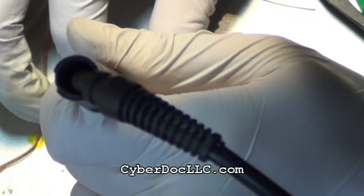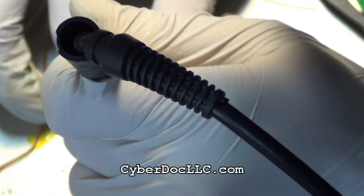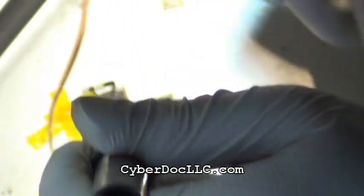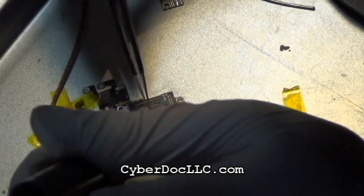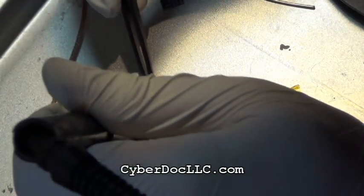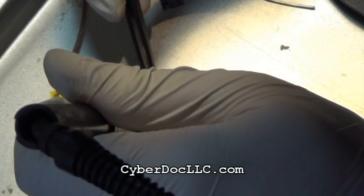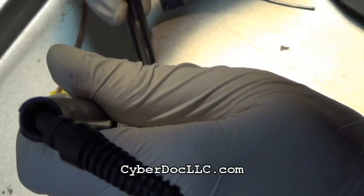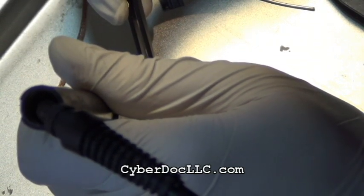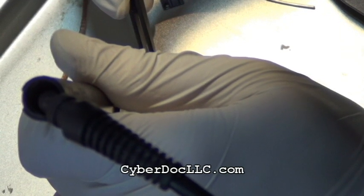Right, so yeah, and then you can remove those little filters, there's three of them, without damaging the logic board. You do not want to lift these pads because they're very, very sensitive copper trace pads. Any excess pressure, meaning if you don't have the right temperature or using a desoldering alloy tool, you're going to break those pads when you're using a tweezer to mess with it. So you really need to make sure those filters are removed clean and properly.